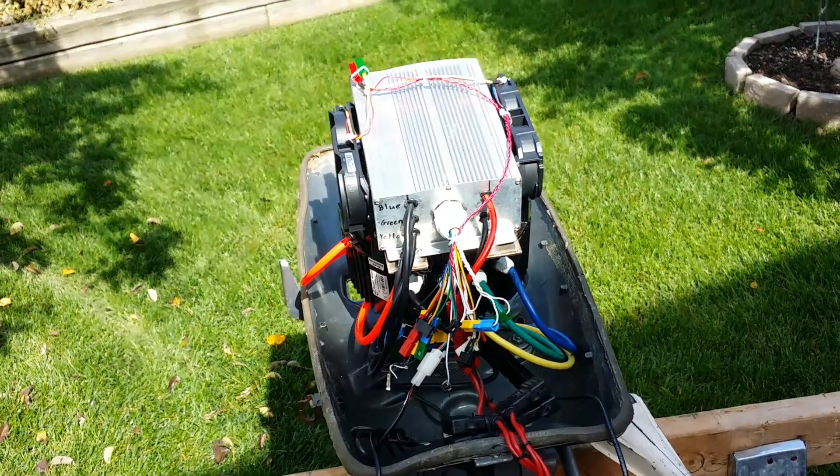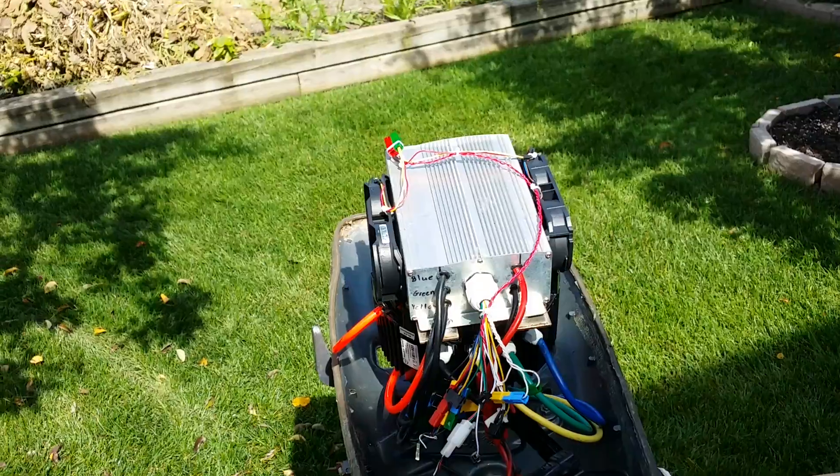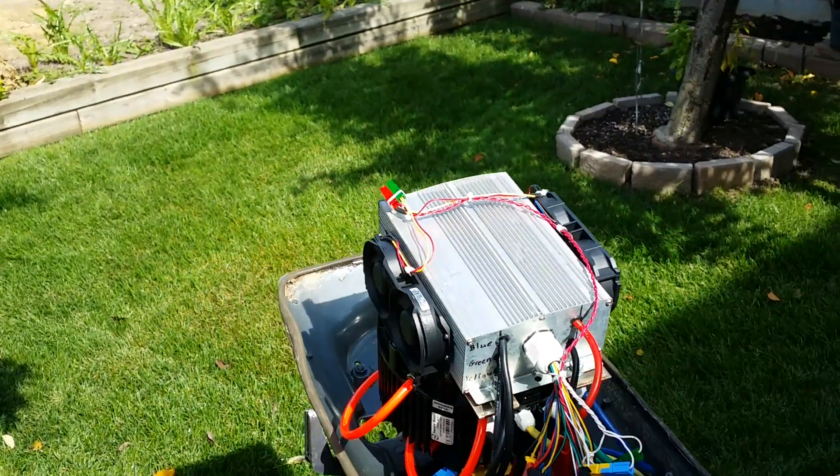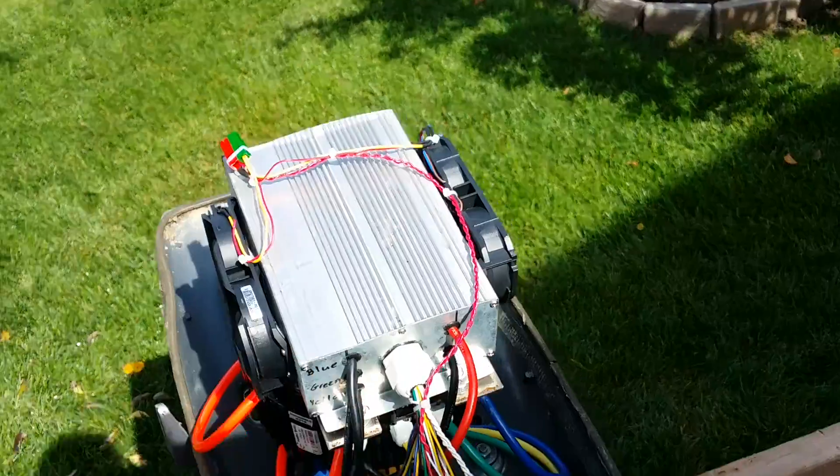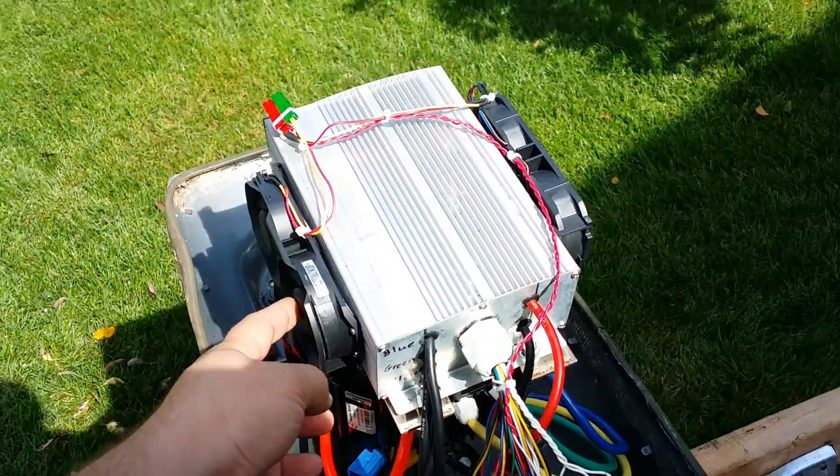When I had this on the water last, I set it at 40 amps battery and just over a hundred phase, and it was getting warm enough that I didn't feel comfortable pushing it harder, so I've installed fans since.